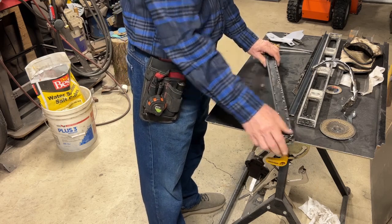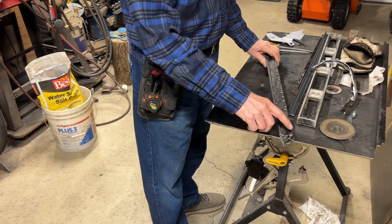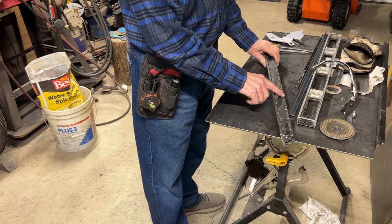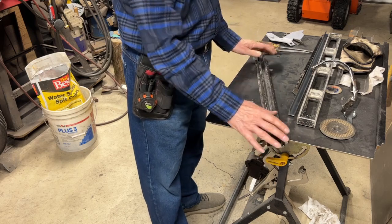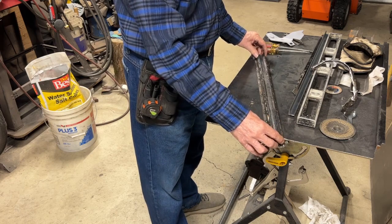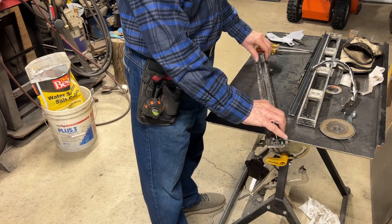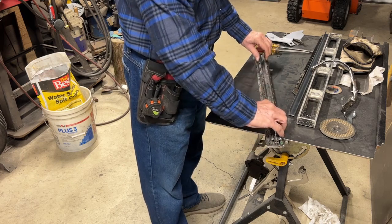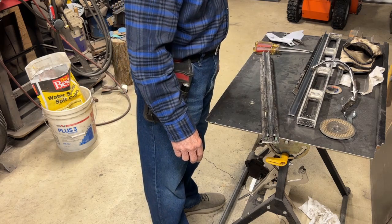And that's also the reason, in addition to saving some weld material and some gas, that I just did individual tacks along here. That should be plenty strong enough for anything I'll do that's that long. And like I said, saves me weld material and gas and time. So that should be the finished product right there. And we need to go test it now, see how it works.